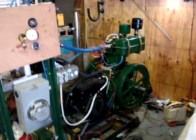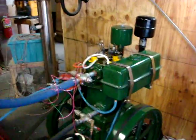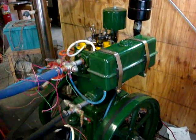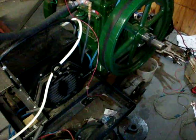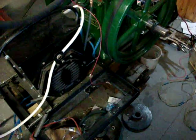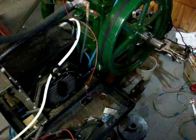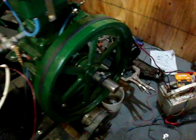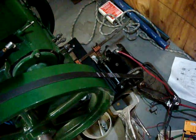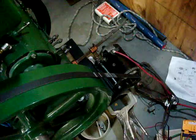Here's a few pictures of the current state of my Lister 6-1 3-kilowatt generator project. I had an electric starter generator from a golf cart set up, but I had reversed the rotation to accommodate mounting, and the generator portion didn't work. So I remounted it temporarily on the back, put the rotation back to the factory's specification, and lo and behold everything works.